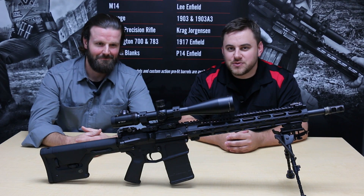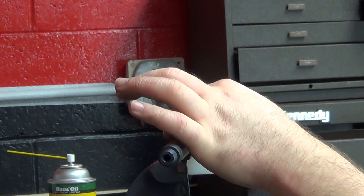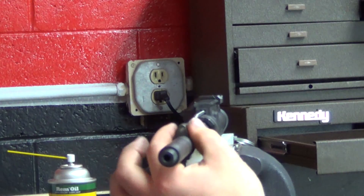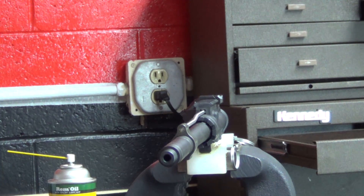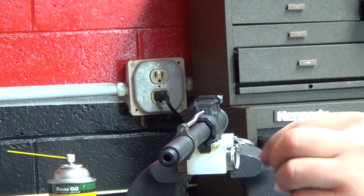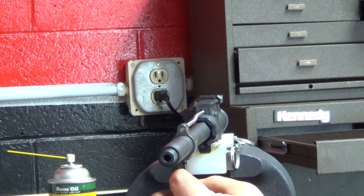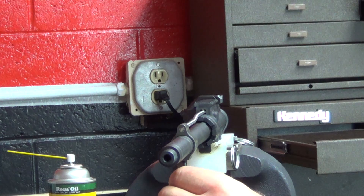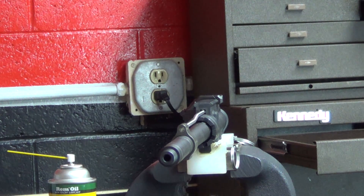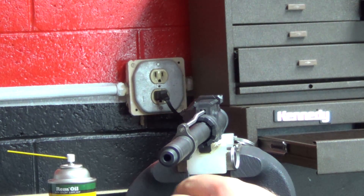Let's pan over to our armorer Nick in the gunsmithing room. Nick is going to install the gas block onto the barrel. We have a nice little feature — dimpling opposite of the gas port — that allows you to index that gas block very easily. A really good way to ensure proper tension on your gas block is to use two fingers and a small Allen wrench. It really doesn't need to get cranked down very tightly. Anytime you're touching the barrel, making contact with it, or putting pressure on it, you will be affecting the harmonics. Everything affects accuracy, so you're not going to want to crank that screw down too tight, because otherwise you're going to start displacing metal.